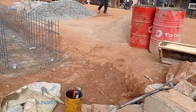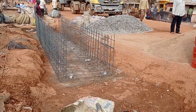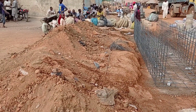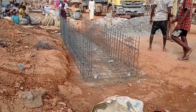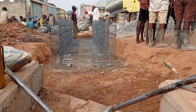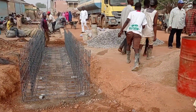The end-to-end width of our culvert was maintained at 900 millimeters, similar to the width of our drainage. The height was maintained at 500 millimeters, and the thickness of our concrete base was maintained at 220 millimeters.